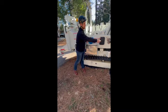As you guys know, on these chippers, you can ruin a set of knives in 5 minutes. You could ruin them in 50 hours. It 100% depends on what you're feeding through it. If you're sending a lot of foreign debris, a lot of rock, a lot of dirt through it, you're going to toast those knives really quick. If it's 100% clean wood, I'd say realistically 20 to 30 hours before you're flipping those blades around.